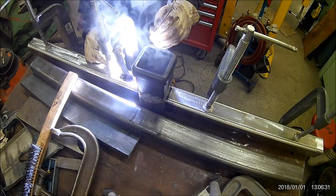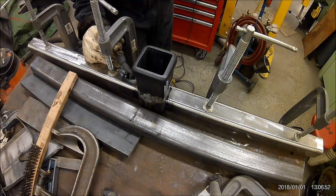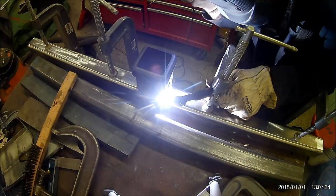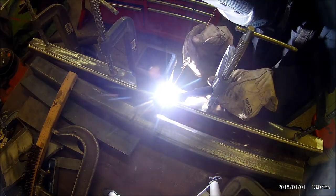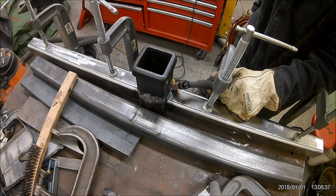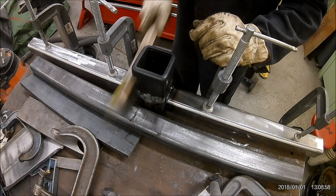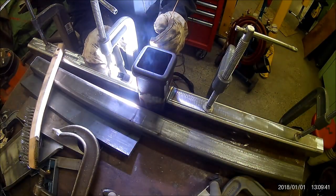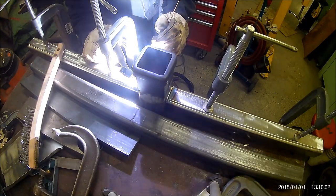In this case, I'm pretty sure I'm using a 3/32 tungsten rod, ceramic cup, ER70S2 filler rod. Can't remember. I usually just go to the welding supply store and say, I would like TIG rod steel, please. And this is what they give me. I usually feign ignorance. And they usually laugh, so it's good.